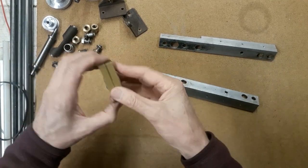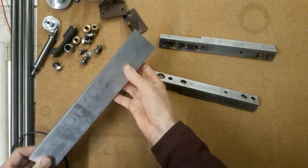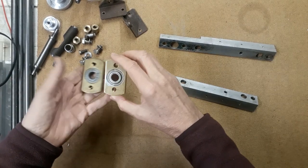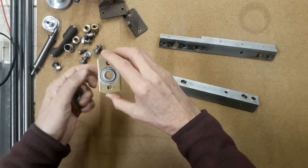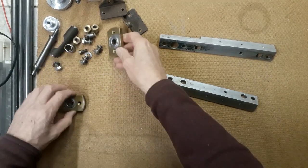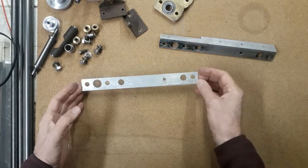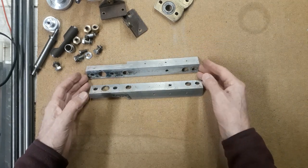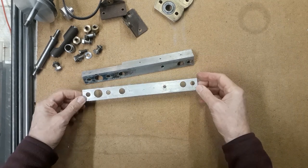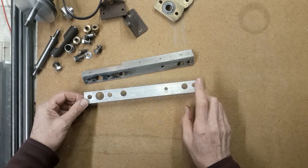So I'm thinking of upgrading these with aluminium and I have some stock aluminium here which I hope to use. I probably will also use this opportunity to replace the bearings. These are very ancient bearings and one of them is a little bit rough, so I think while I'm at it I may as well change those. The other thing I've already mentioned is the length — this can be made much more compact and I'm going to do that. We'll have a look at the drawings and then get to shortening these and repositioning these holes.